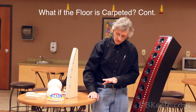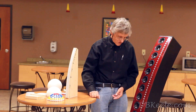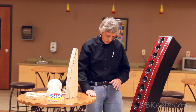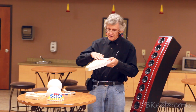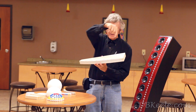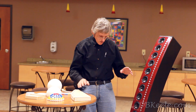Listen to this without a rug on the floor, like a tile floor. You can actually go five or six feet away from it, lay down on the floor, and listen to it — and it sounds great. You can also stand up. My experience has been that if you do that on a rug, the high frequencies are going to roll off, primarily because the grazing incidence absorption of an absorber gets greater for sound traveling across at grazing angles, and much less for sound going straight down and bouncing back up.